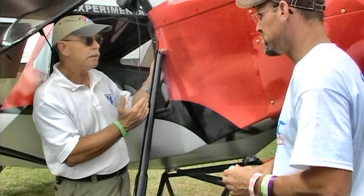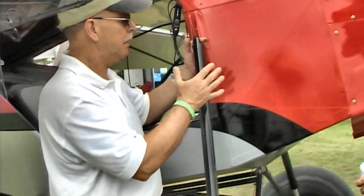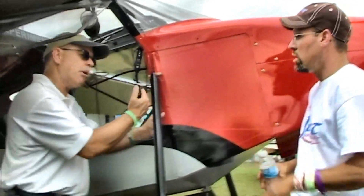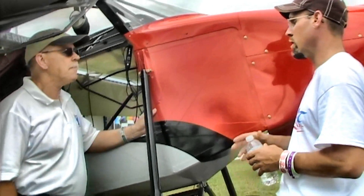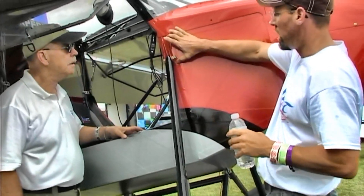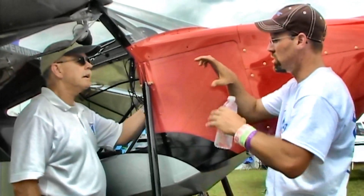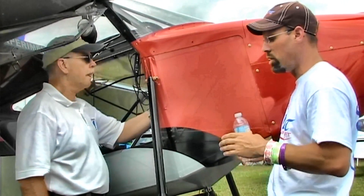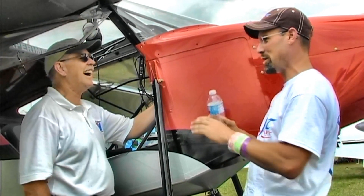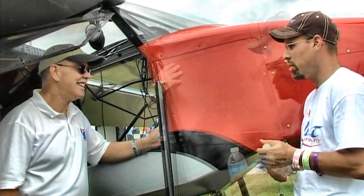The tire's not doing the absorption — it's the stroke that does it. But all that load has to go up into an airframe. Did you do anything different up here structurally? Yeah, to accommodate the loads we built a truss — there's about a five-inch truss right up in there across the back of the panel. A lot of guys are complaining about fitting their avionics in there with that big truss, but that's second to what we really need structurally.